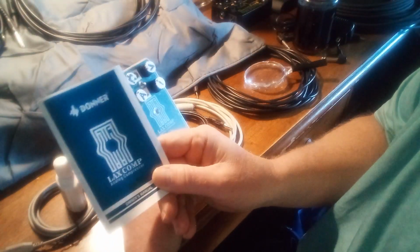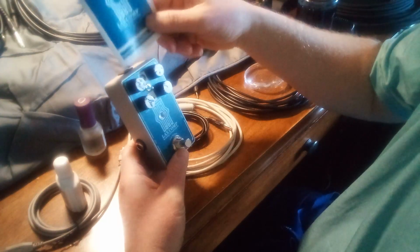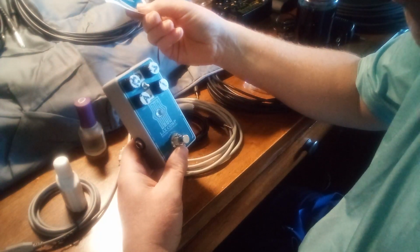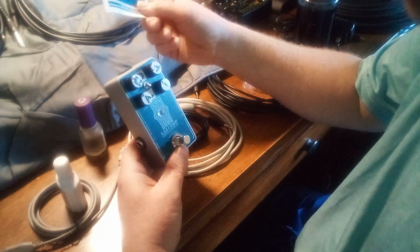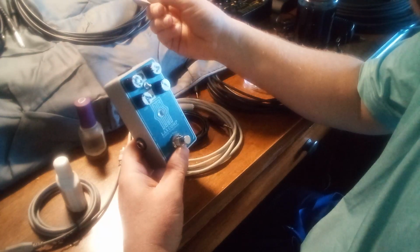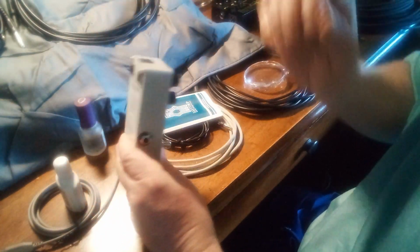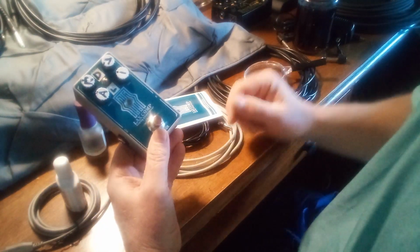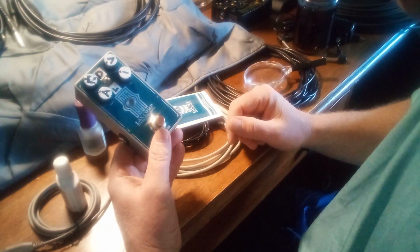In these directions, it talks about this is 50 milliamps or less, which is basically a 9-volt battery. I have a connector I made with a negative center, so I can connect a 9-volt battery, but maybe there's a reason they don't have a battery snap in here. Maybe they don't want you to hook up a battery. Maybe it will just draw too quickly, or it will sag too hard or something.